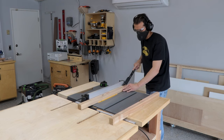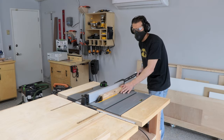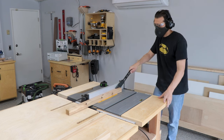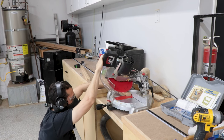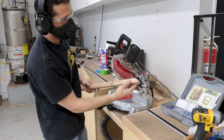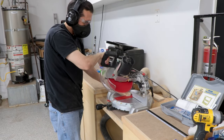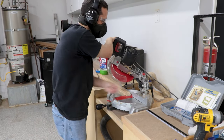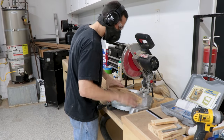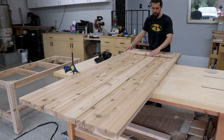To help keep things even, I'm making two brackets to go underneath on the edges. I rip down a piece of cedar a little shorter than the length of the finished top, cut a small profile on each edge — not all the way to the tip, just enough to make a nicer look that's harder to see. Then we cut our top pieces to near their final size but not all the way — we'll trim those later.